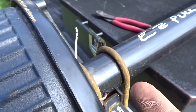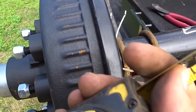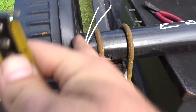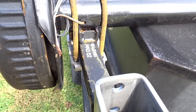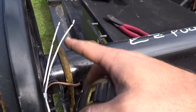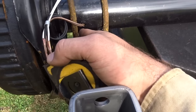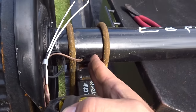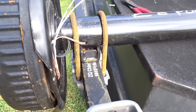We could go 7 feet overall width, but it only gives us an inch and a half, inch and three quarter at the most, between the backing plates on the axles. So we don't necessarily need to go 7 feet wide. We could, but we don't need to. An extra 2 inches ain't gonna hurt nothing, or 2 inches less, I should say. So we're gonna go 80 center to center on the frame, but the actual frame itself will be 82 inches outside to outside.